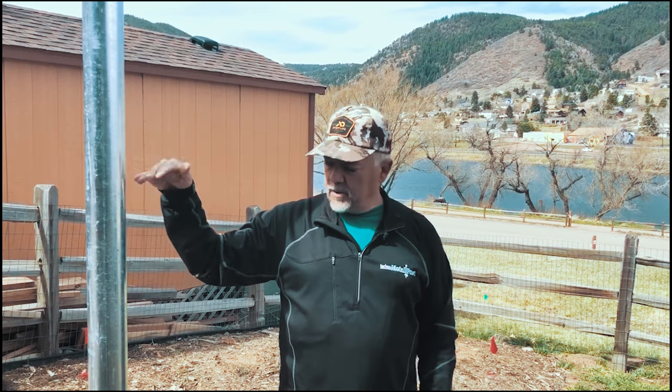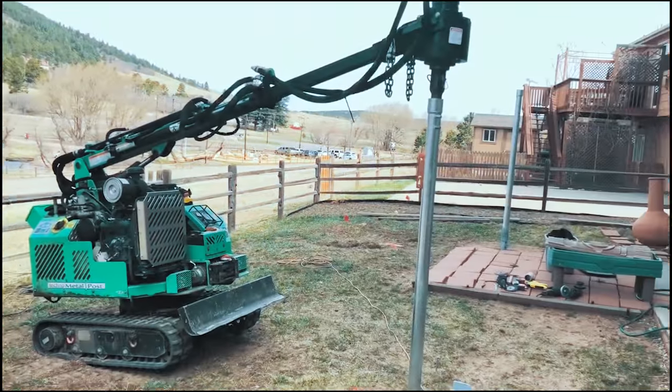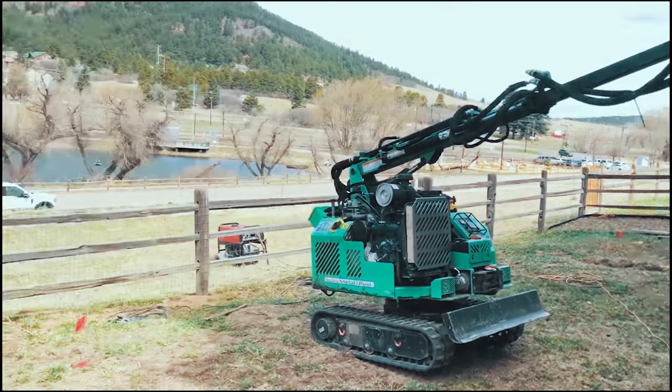So we had to add these on. We did one pier already that's down about nine to ten feet and that one has good torque, so we will probably end up cutting that one off a couple inches above grade and putting a pier cap on for a six by six post and we're done. It's a pretty quick process and definitely better than a concrete caisson. In this situation with very soft soil, caissons are probably going to settle and sink over time. Our piers are guaranteed not to settle, sink, or move — it's an engineered product and one of the reasons that we are the worldwide leader in helical pier foundations.